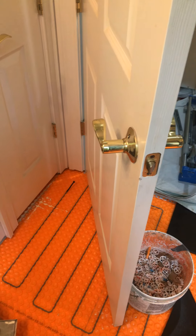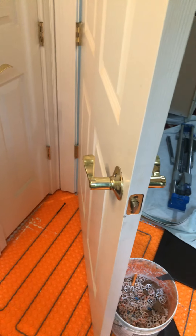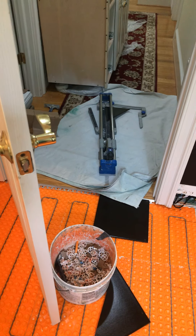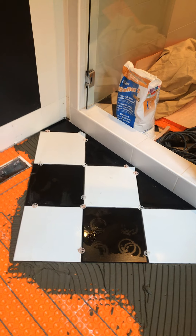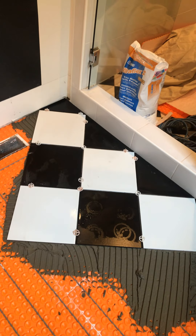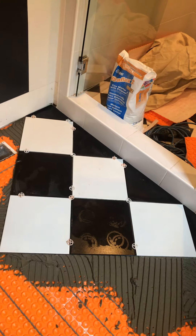As of now I'm just looking forward to getting this floor laid today. I may lay all the floor and then come back tomorrow morning and do the closet and get everything grouted up, because that closet is just so small — you don't want to run the risk of getting everything twisted right there at the door. Cleanliness is a must, because you can't scrape the joints tomorrow due to the fact that there's wire down there. The first time that razor blade hits that wire, it's done — you've got to tear it all up and redo it, and that comes out of your pocket.